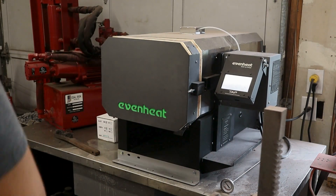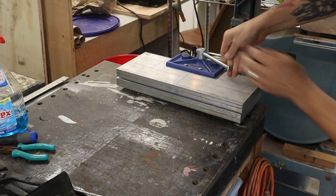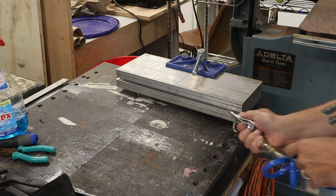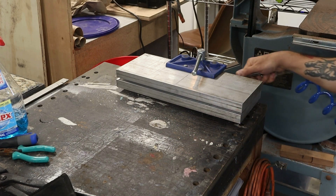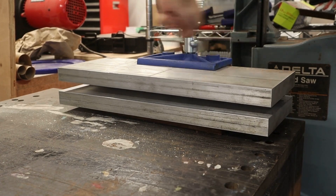I'm holding this at 1950 degrees Fahrenheit for 30 minutes before plate quenching. I plate quench this between two 1-inch aluminum plates along with some forced air from the compressor. Surprisingly enough, these plates usually have a blade cool enough to touch in less than a minute.